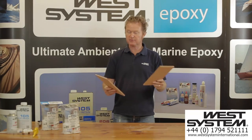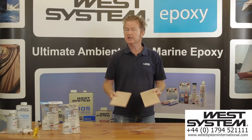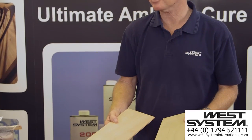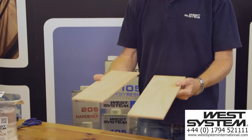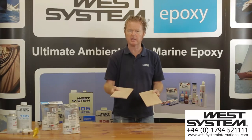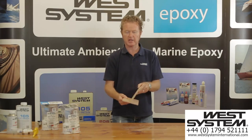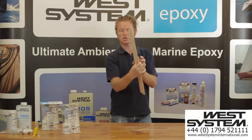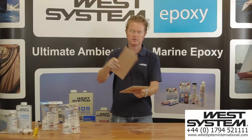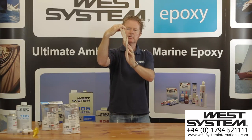Surface preparation is very important. Surfaces need to be clean, dry, free from dust, oil or any contamination, and well abraded. Plywood tends to have a release agent on the surface. A very good idea to sand plywood and ensure that you've removed all the dust before you bring the bond together, either for a joint or for a fillet or for lap strake construction in a plywood dinghy.